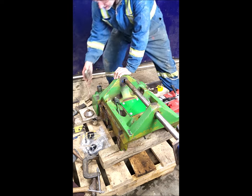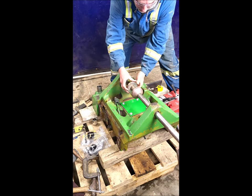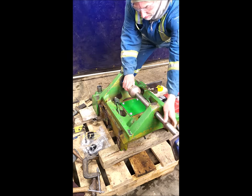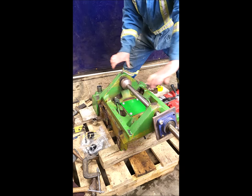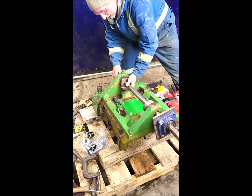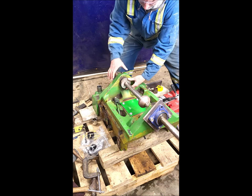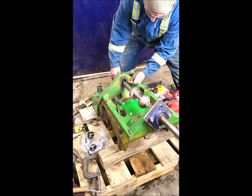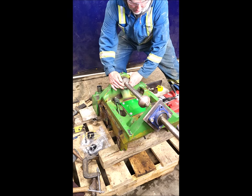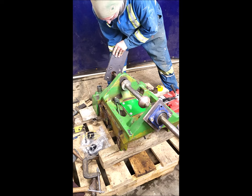These are just some quick alignment tapers that allow you to taper the shaft to the original centerline of this bore. It's a real fast way to make the bores run true to one another and true to the original axis that this was machined on. They just kind of line up and allow you to center the shaft to the original hole. This hole is pretty worn, but we still have 180 degrees of bore there that's factory - I think it's going to be really close. This end, same thing - just another flange bearing.